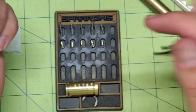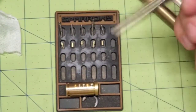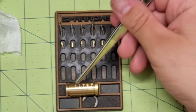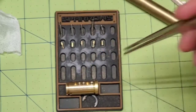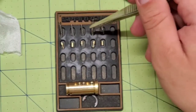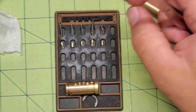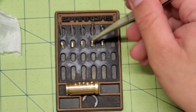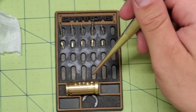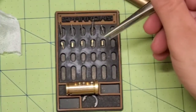Now, because of that and how my pins are going to interact, that's how I pick my springs. So on chamber two and chamber five, we've got a lot of room in the core before we hit that shear line. Because our driver pins are even fatter, or not fatter, sorry, when they're longer, I want super heavy spring tension in both of those chambers, so that there's a lot of fight there.